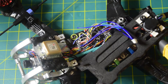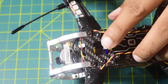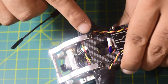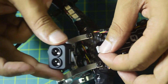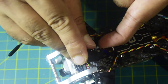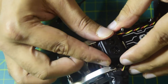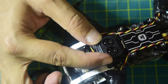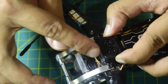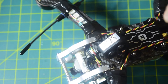All ports are now connected. Let's quickly install the sonar sensor onto the drone frame. I have routed the JST connection to the back side — the wire runs from the flight controller all the way to the back. Let's connect the sonar sensor to this JST — ensure it is in the right direction. This is the position I am going to install the sensor so that it faces the back and the bottom, to sense the distance and height at which the drone is flying.